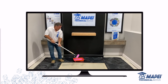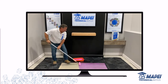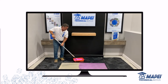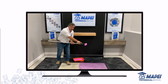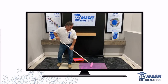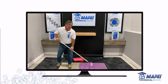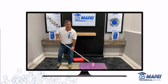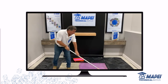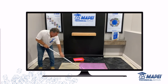Roll toward the hard side of the roller. When you roll to the soft side, you leave W-shaped overlaps with two to four times as much product — that takes two to four times longer to dry and wastes product. By rolling on the hard side, you're feathering out and getting rid of those W's, creating a thin, monolithic layer of material that dries evenly. Let the roller do the work — don't apply pressure. If you're squeezing out material, you need more product on your roller.